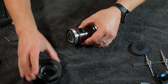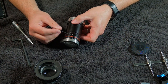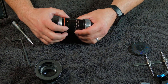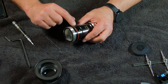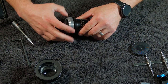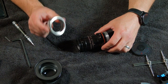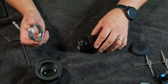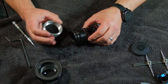So I'm going to take this apart and show you. There we go, comes right apart. There are little tiny set screws here — one here, one here — you can loosen those and this front piece will unscrew and move in and out. So if there is dirt or something on the inside you can loosen those and this will come apart. This ring right here — if you find these, look for one of these. This is what you would use for the Series 7 adapters. I'm not sure what size thread this is; you may have to make some of these adapters if you can't find them.